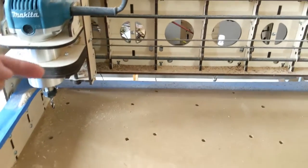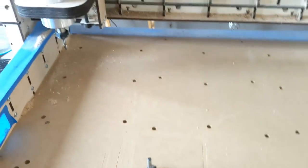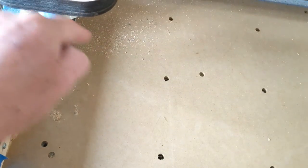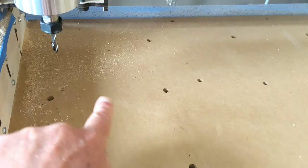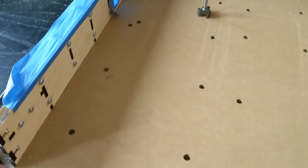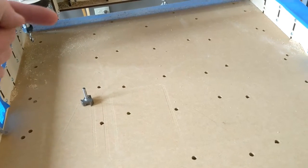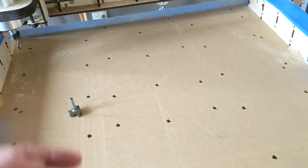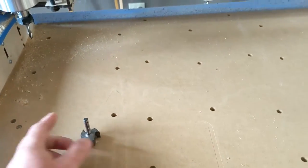Your Y is always going to be in the plus direction, and your X will always be in the plus direction. If you write your own program, the tool is going to come over 2 inches and ramp down at 25 inches per minute. Then it's going to start a cut over to 0,0 and profile the entire thing on a climb cut. Then it's doing step-ins of 1 inch, with a little ramp-in on each step, coming all the way down 24 inches. It picks up, goes back, and does another step-in in the already cleared area — stepping an inch at a time, with a little bit of overlap on the cut, stepping all the way across.